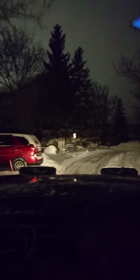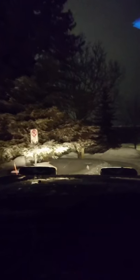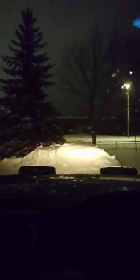Far left, I picked up the curb itself there. So yeah, I went down the curb. You don't want to smash the plow into the curb. You just want to lightly touch it. There's a bit of a crack in it there. You can tell because the plow kind of bounced on the crack. My curb now on this side. Nice and in the middle. When I go back up there, you should be able to see that the curb's nice and clean with minimal snow windrow out to the end of people's driveways. It'll be a little bit just because it is pretty deep today. So the plows aren't going to peel it all the way. There's about 6 inches or so there. So it's not going to peel it all the way, but it'll sure as shit try.